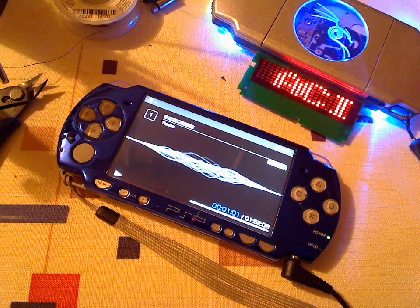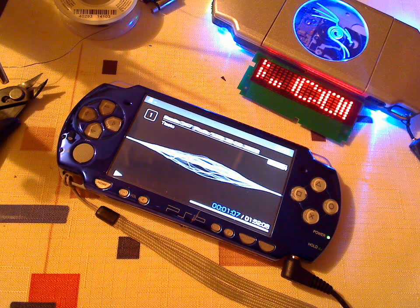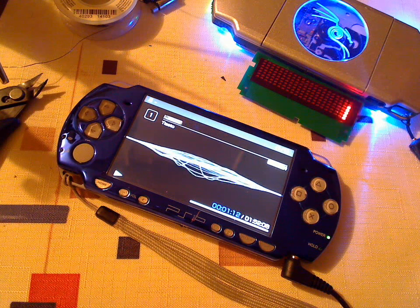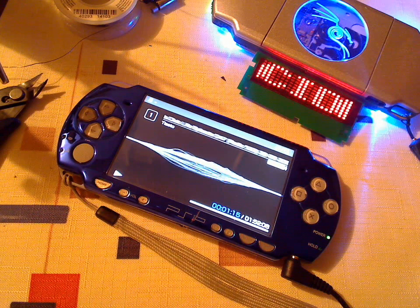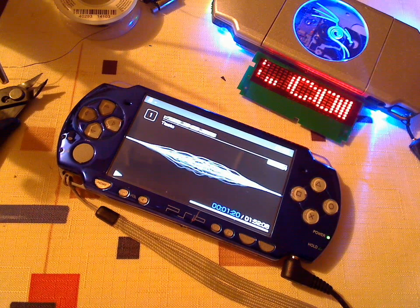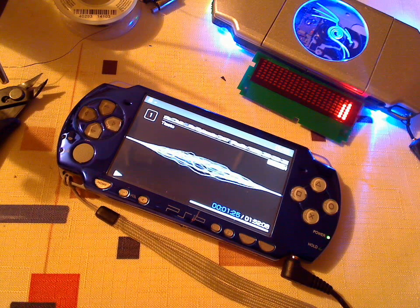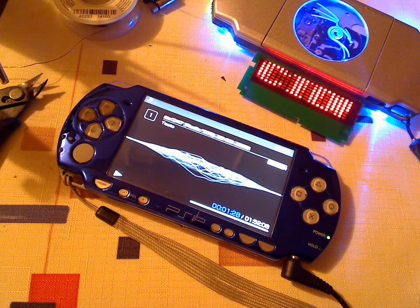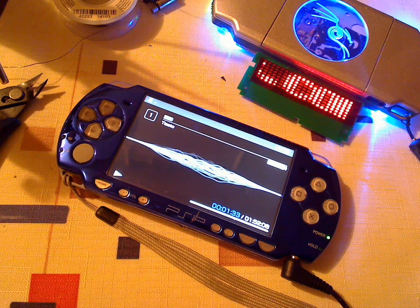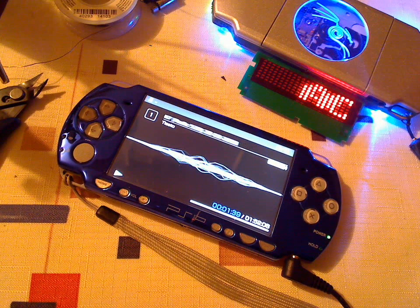So let's take a quick look at what's going to happen. I'm going to hold the note button down and that's going to turn on my LEDs. Hold it again and it will turn off the LEDs. The cool thing about this is it retains all the button's original functionality. The button is a note button, so if you hold it for one second, it mutes the PSP, or if you have headphones plugged in, it changes the electronic equalizer. The trick of all this is timing — if I hold that button for a half a second, that's when it will activate the switch and turn on my LEDs, or turn them off if I hold it for a half a second again.